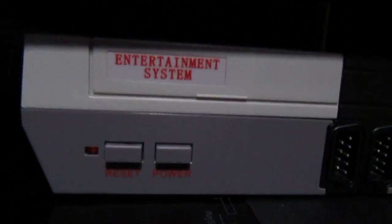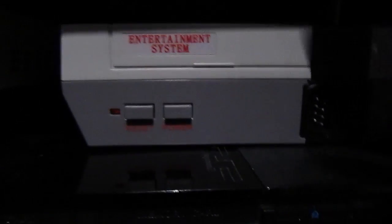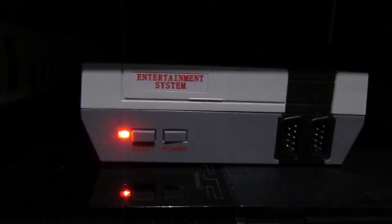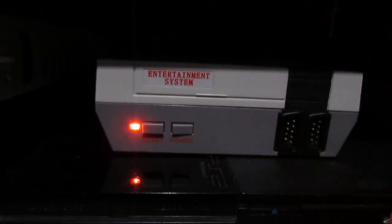There are a couple of things I had to do to get the LED to light up and the buttons to work. You need to run a script for the buttons, and you need to edit the config and add something about UART ARM. I will add the text you need to add in your config if you don't have it, for the I/O pins to get active in serial mode so the LED gets power. I will also add a link in the description for how to add the script. Press the reset button to start and to shut down RetroPie. The power button is just for the LED, so you can turn off the LED if you want.